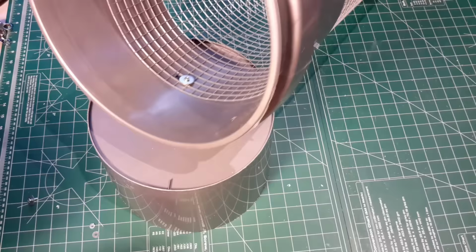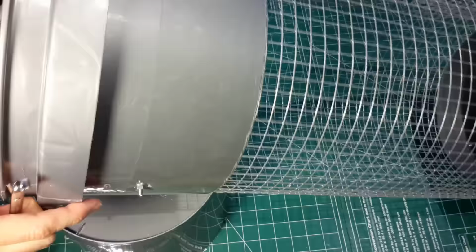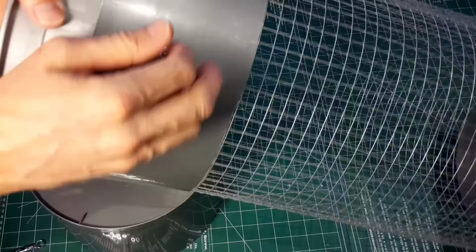The outfeed side again has 4 screws just like the infeed side. Those will be secured with 1/2 inch number 8 bolts, again using fender washers on the inside with the head of the bolt also on the inside of the bucket so as to minimize the amount of debris caught by the bolts.